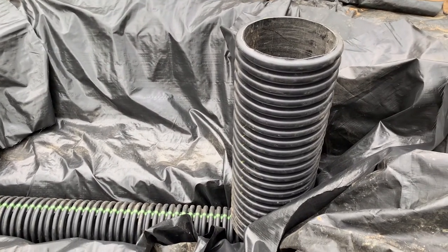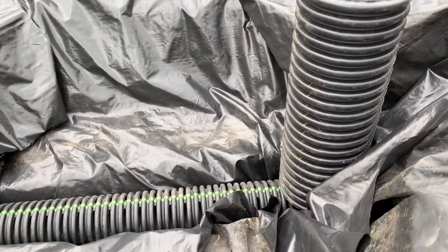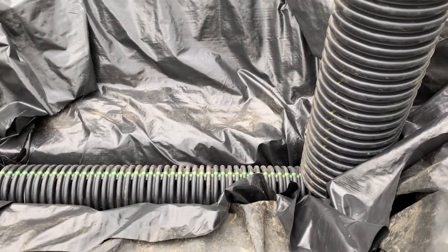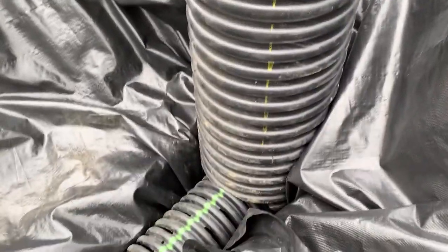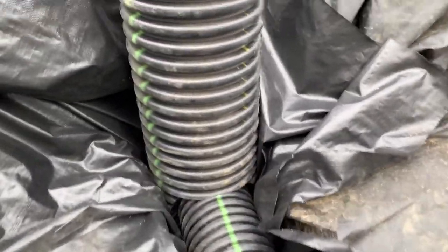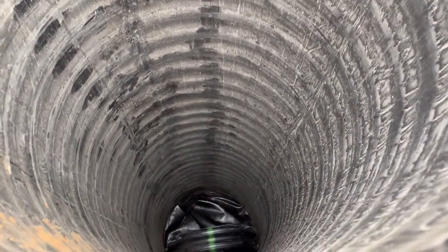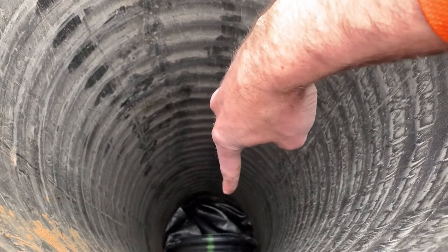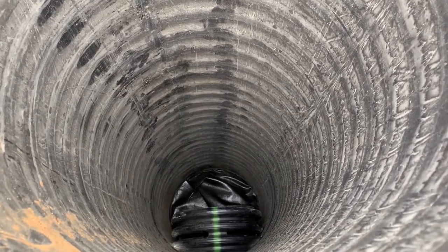This snorkel unit — in case I ever need to clean out the wetland, which I probably will at some point — as suspended solids in the water settle to the bottom, or if it gets clogged and I need to back flush it, you drop a pump down this tube. I've cut a hole in this big 18-inch piece of culvert to accept this 12-inch piece of culvert. If there's any junk down there, silt, or debris, you can throw a trash pump down there and pump it out.